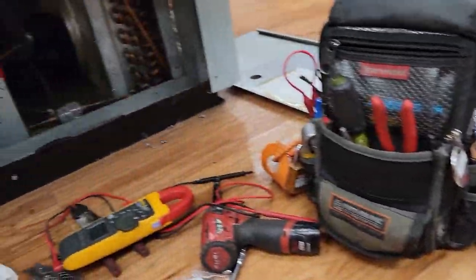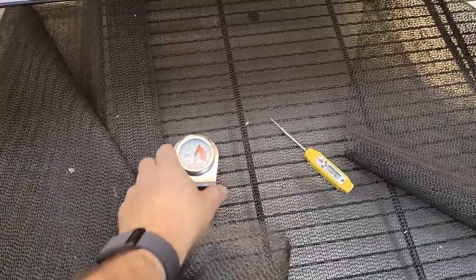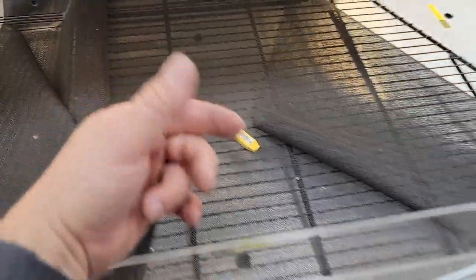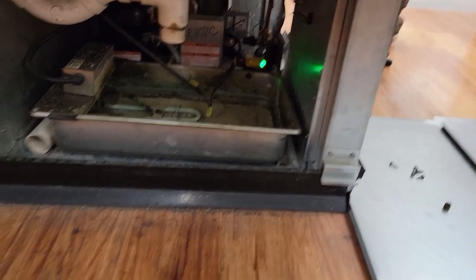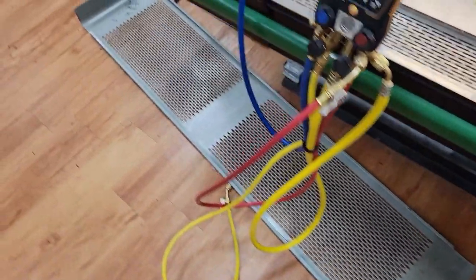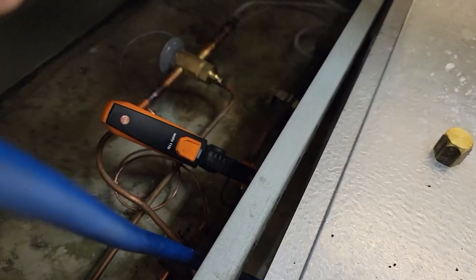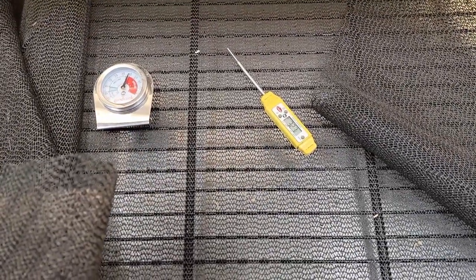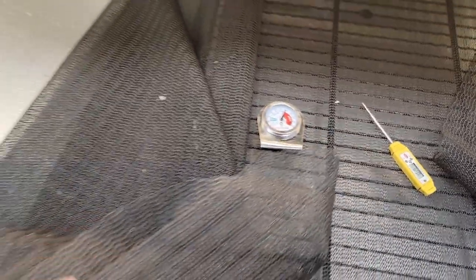What we've got now is one side getting about 5 degrees colder than the other. We're checking refrigerant pressures — hard as heck to get into that, but we got in with the probe instead of the gauges, since I've had nothing but problems with these hoses. We're adjusting the TXV; we were at almost 16 degrees of superheat on it, so we're trying to get that down to around 8-9 degrees.